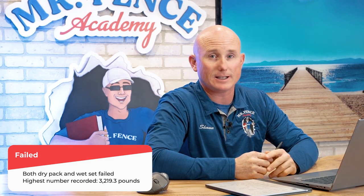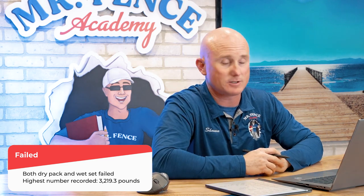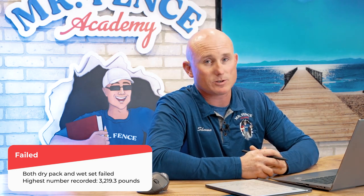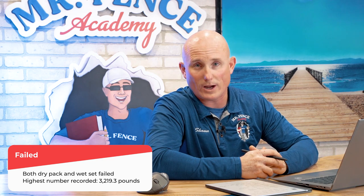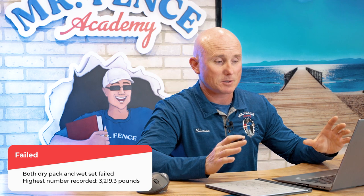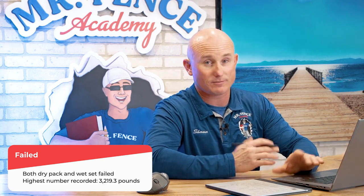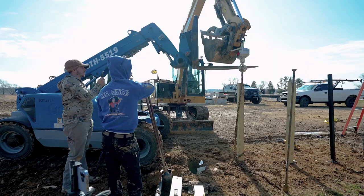We ended up putting a lag in it, tried to pull it out, that lag broke. We're dealing with a lot of mud, cold weather, it's freezing out there, and it was not great conditions. The dry pack vinyl post broke off multiple times. The extractor wasn't working well in that muddy, wet condition with the destroyed post. So both those footers, we did not get data on uplift on either one because the footers were set so well.